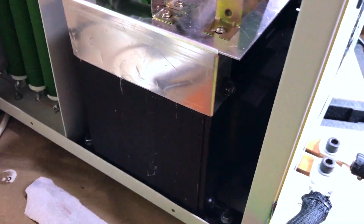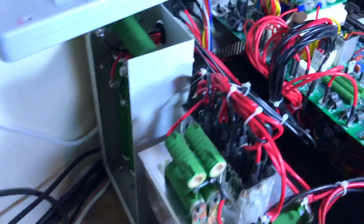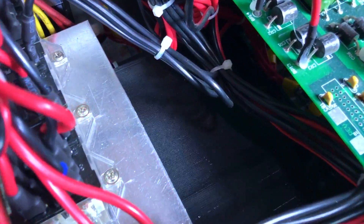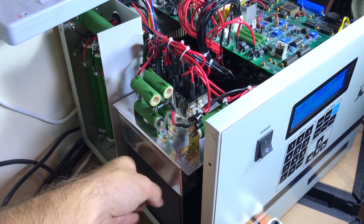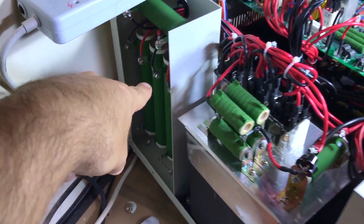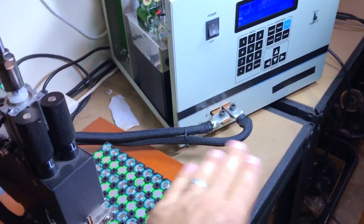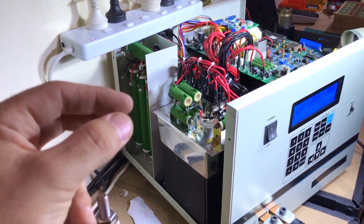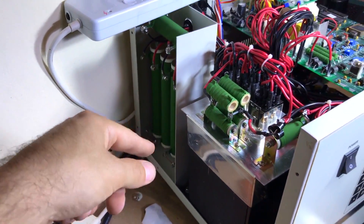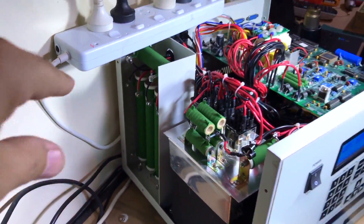Let me show a little bit of the electronics inside. You see this massive transformer here — let me bring the light. It's a massive brick — this thing weighs 70 kilos thanks to that transformer. And then you have these massive resistors. What happens is when you dump all this load to the batteries for spot welding, you only use a fraction of the energy, and you need to dump whatever was not used back to the resistors — otherwise something's gonna explode because there's too much energy flowing. So it dumps back to the resistor.